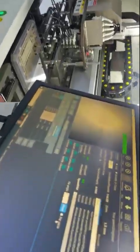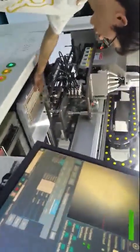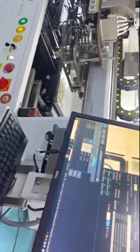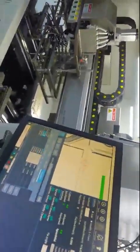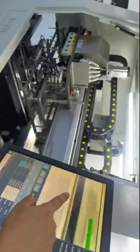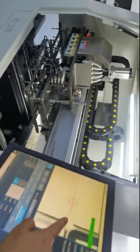Open the door and place the board on the fixture for tuning. Click to choose 'fix vacuum' — the fix vacuum is now on. Then set the run mode to CCD for test only, not cutter mode. Press coordinate number one — the XY picture moves to the back side to check the start point and end point.